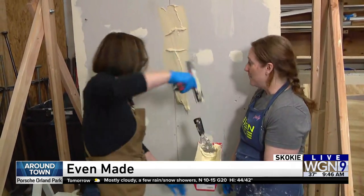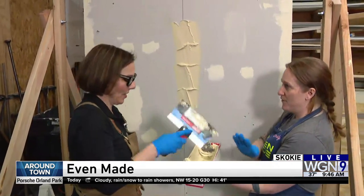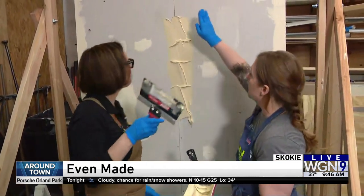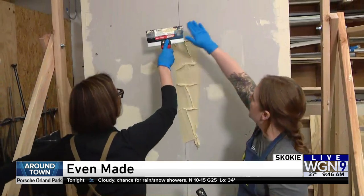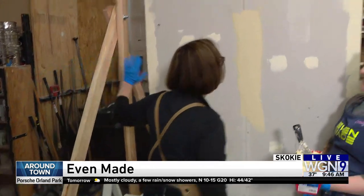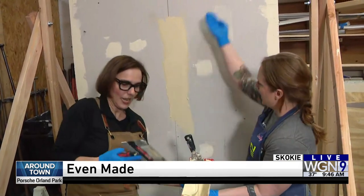It's perfect. Can I do that thing? Yeah. First you want to scrape off your knife — this is called a taping knife. Now you start at the top, you get a little pressure in the middle, and then you pull down. Pull down. Again. Clean it up and go the other way.